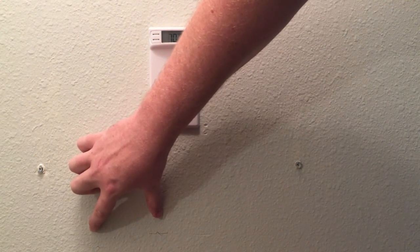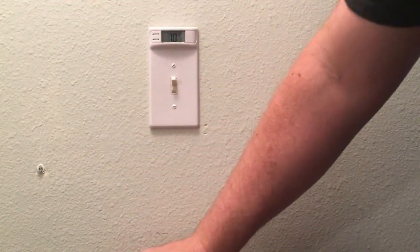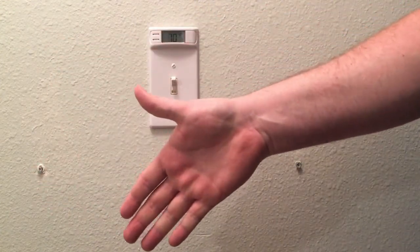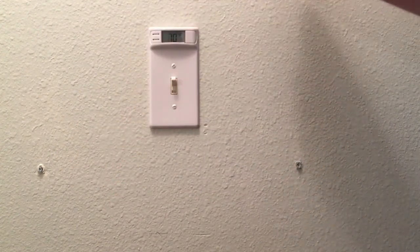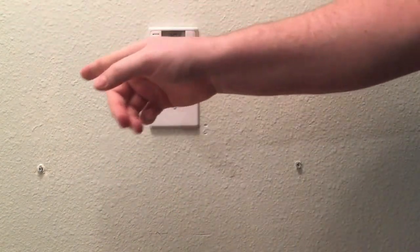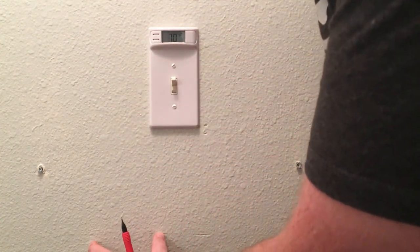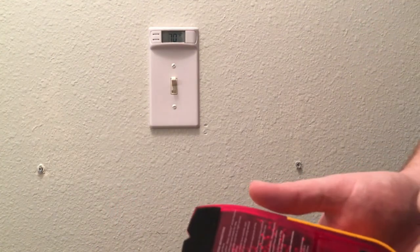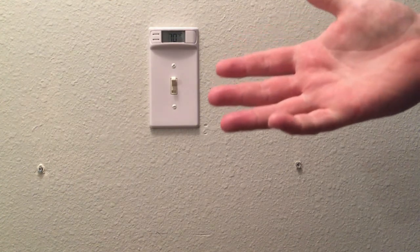It's telling me it's way over here, and that's too wide to be a stud on edge. What this probably is — because that's about the width of the flat side of a stud — is probably the studs for the wall in the back of this closet, in the corner of the next room. So we've got plenty of area here that if we drill into this you'll be able to hit stud.